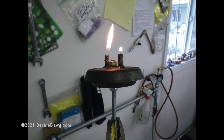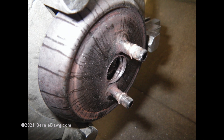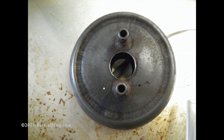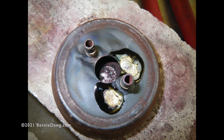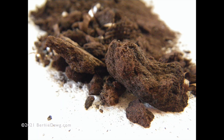So I took it apart and then tried to clean the crud out of the burner with a torch — no sense in trying to machine things with goopy stuff inside the burner head. I increased the diameter of the spigot tube by about 25 percent. I also patched the two small holes that had rusted through this steel burner with some silver brazing. Inside the burner head was a lot of this stuff, which I determined was the result of rusted away iron or steel mesh.